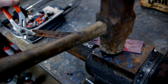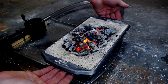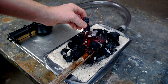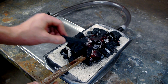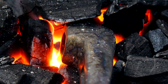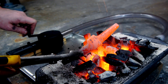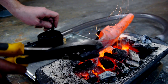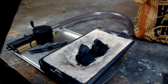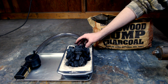Let me go over a few of the things I like about this forge design. First of all, most of the heat is directed upwards so the forge itself stays relatively cool to the touch. Charcoal is quite a good insulator as well, so though I don't recommend it, you can grab the outside of the coals and adjust them by hand without burning yourself — it's only very hot in the center. Since the forge blower is fueled by hand power, you save a lot of charcoal by not turning the crank when items are not in the forge. Combine that conservation with no use of electricity and it's a pretty efficient design that can be used in any situation. You could even make the charcoal yourself, just as it's been done for centuries. Charcoal and fire is where all the heavy machinery we have today first began.